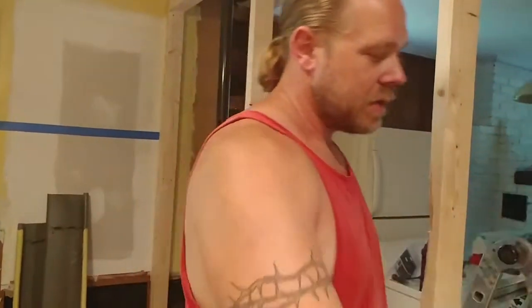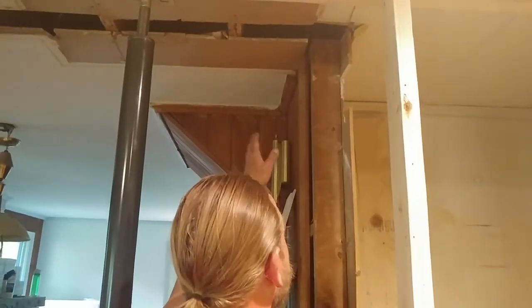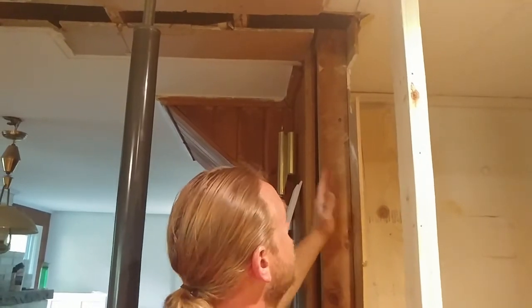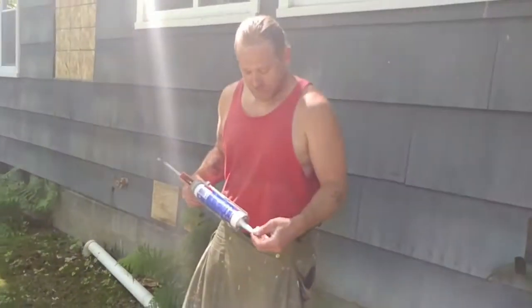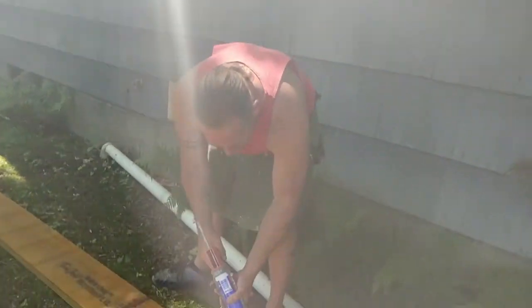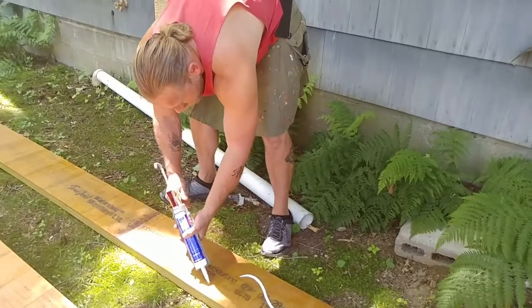So now take a look up here. Before we get started on step-by-step how to build and put the new beam in, we've gotten rid of everything here. We're going to put in a king stud and a jack stud, double up the micro-lam and slide it in, nail everything together, and then we can get rid of this wall. Let's get going on that.